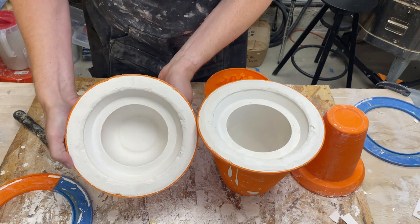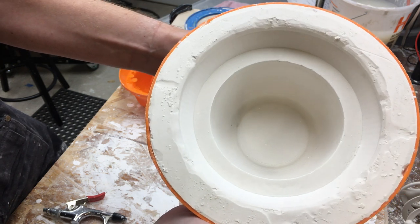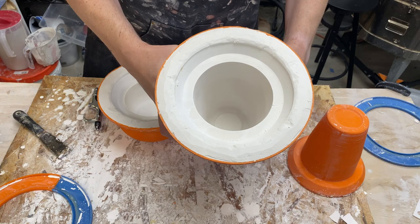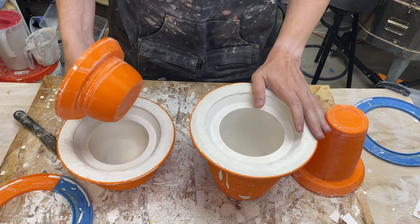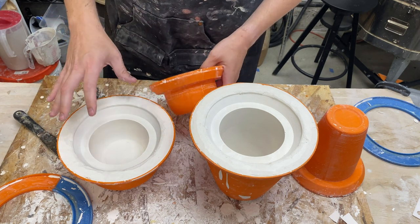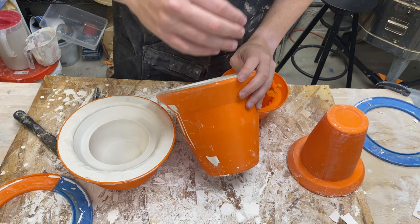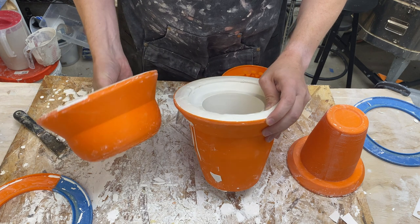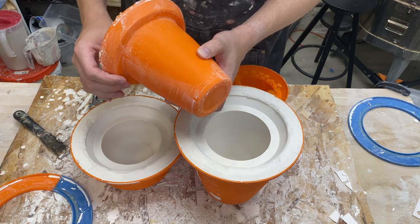The molds actually look great. I don't see any bubbles in the surface of the mold. The top rim needs to be cleaned up, and here's the other one — also looks great. It was a bit of a struggle getting these out, and that's one of the challenges of using 3D printed parts with plaster — both are rigid. For the outside shell, since there's a ton of surface area and fair bit of texture, I'm just going to cut these pieces off rather than struggle pulling them out and potentially damage the plaster. These were the quick prints, unlike the inside forms which were slow high-resolution prints.